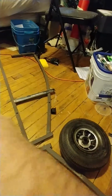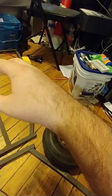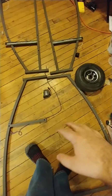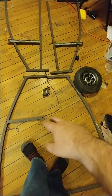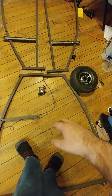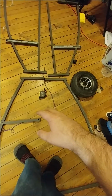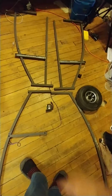And then the back axle, it'll be a solid axle with pumpkin. And I'll probably integrate my Red Cat Racing parts into the differential. So I'll be using the Red Cat gearbox and the hubs and stuff like that, running them through. And then probably the Red Cat Racing dual steering servos, and the steering arms are probably custom. It's hard to say, I might use some of the parts. Maybe use some Heim joint rod ends instead to reinforce it, so I can still make them adjustable, and then have my tie rod or my steering links coming out.